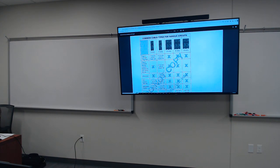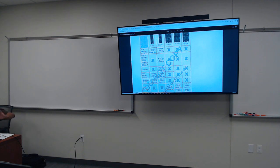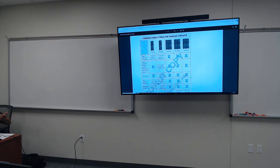I actually got the resource for you. So this right here, and everything that we're showing, we're gonna go over again in depth. But this is the skim the surface. So in your residential home, a 15 amp breaker, commonly you find on a 15 amp breaker, plugs, switches, anything in the living area. What size wire? It's gonna be a 14-2, okay? Also, what you can find on a 20 amp circuit breaker are plugs and switches in living area, all right?